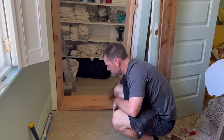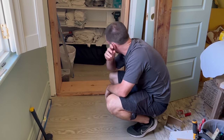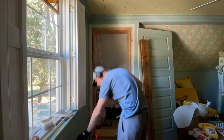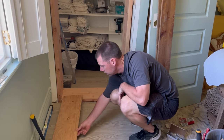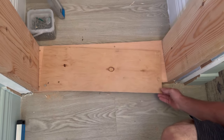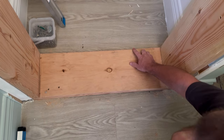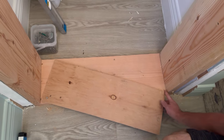One of the key parts of this project is creating a test piece. All it needs to be is a really thin piece of plywood. You're going to cut it for what you think the footprint of your bookcase is going to be, and you can only know what this is by cutting it out and testing it. You cut out your piece of wood, nail it into the bottom frame, and swing it to see if it can open and close. If it can't, you need to take it out and cut it smaller. Once you get it to a good size, that's how you'll know the depth and width of your bookcase. Then you can measure the height of your frame and take maybe a half inch off — that's going to be the height of your bookcase.